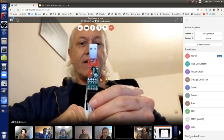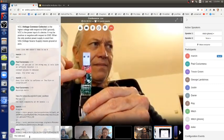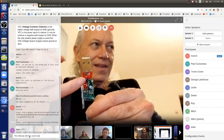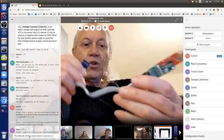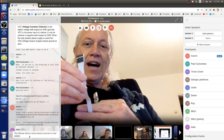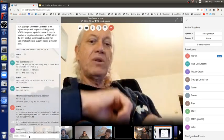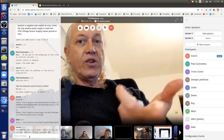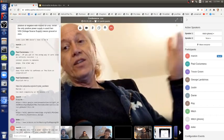There's a lot of different ones. Like I said, this just has, you can sort of see the USB controller chip underneath there. You just need a board with a USB controller chip, and then this has the correct pinout. It's a 6-pin thing. There's power, ground, plus some pins on the microcontroller that put it into programming mode. And then you download the driver for that USB controller chip, and then tell your Arduino software that you can use that.